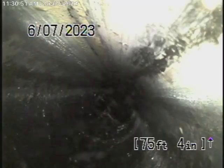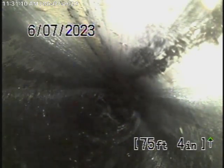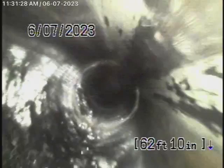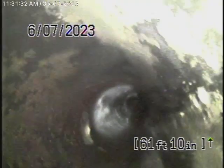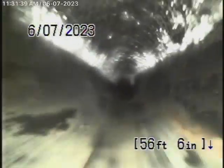We're running a camera from a roof vent. We did that because we like to check as much of the main line as possible, and because the clean-out was so far away from the house, we got up on the roof to confirm that it's all ABS plastic — and it is. We're past the clean-out now outside. This is by the clean-out right outside. Beyond that point we've already checked everything. Now we're coming underneath the concrete slab of the driveway — all ABS plastic, all in good condition.